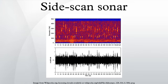Commercial application. The first commercial side-scan system was the Kelvin Hughes transit sonar, a converted echo sounder with a single-channel, pole-mounted, fan beam transducer introduced around 1960. In 1963, Dr. Harold Edgerton, Edward Curley, and John Yules used a conical beam 12 kHz side-scan sonar to find the sunken Vineyard Lightship in Buzzards Bay, Massachusetts. A team led by Martin Klein at Edgerton, Germeshausen and Grier developed the first successful towed, dual-channel commercial side-scan sonar system from 1963 to 1966.